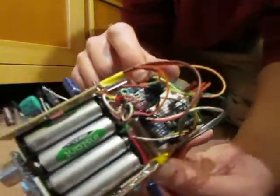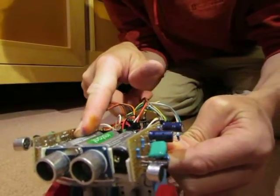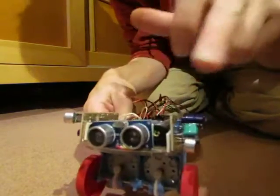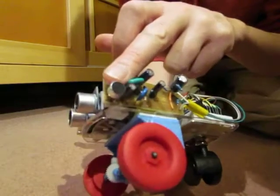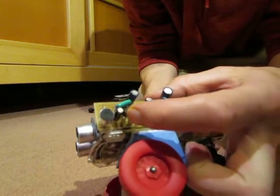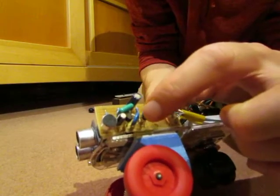It has a DC motor controller running at 4.8 volts. The ultrasonic sensor is not used at the moment. There are two microphones — right and left — and the sound from the microphones is amplified twice, with about 300 times amplification through each transistor.